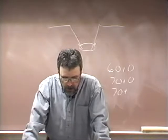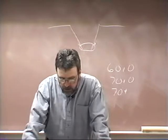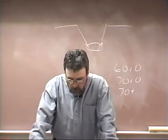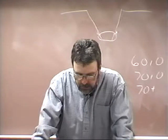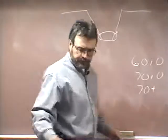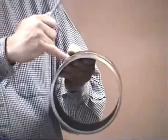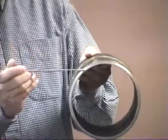I'd highlight this. Increasing the speed of travel, however, can cause pinholes to form behind the arc, usually at a distance of about 1/8 of an inch. When this occurs, the welder must swiftly tilt the electrode holder in the direction of travel and then go back to the original position, as in figure 8-17. Tilting the electrode causes the arc force to push some of the weld metal into this void. What he's talking about is when you're going around here, like so, sometimes you can get going too fast and you'll lose the puddle. You'll lose the puddle and it'll leave a little hole there. Well, if you see that, you got to go back and pick it up. Fill that void and then continue with your weld.